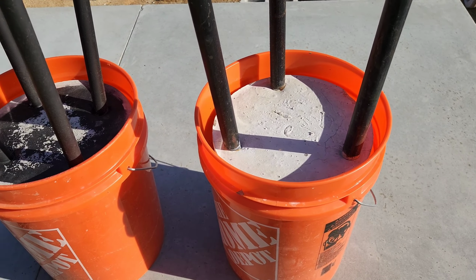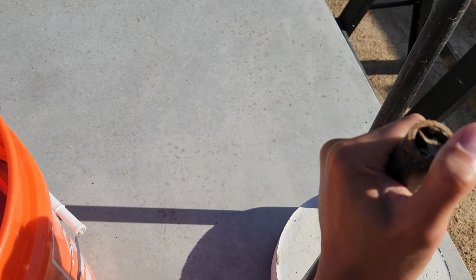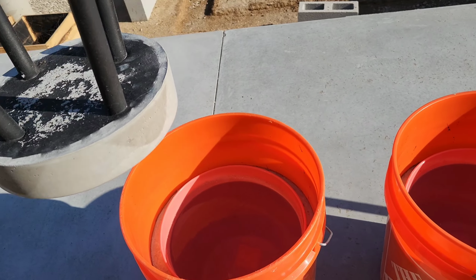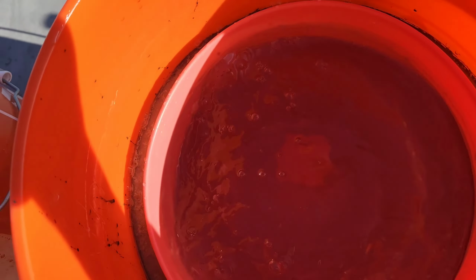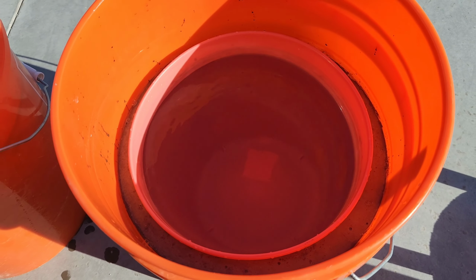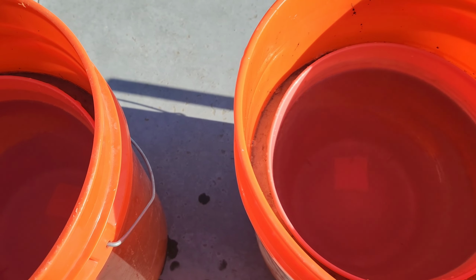All right, guys, it's 24 hours later. I'm gonna go ahead and take this stool off. It's pretty hot outside, so as you can see, the concrete's drying pretty well. Alright, looks good. So you can just kind of wet it down periodically so the concrete doesn't dry too fast, so it can absorb some of the water. So we'll come back tomorrow on day 2 and see what they look like. You might be able to pull these off after 2 more days.